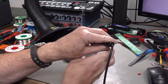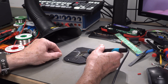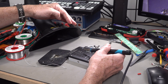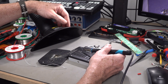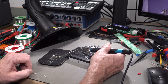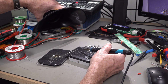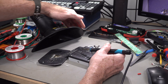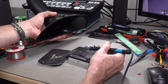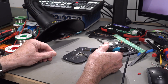I'll give you a close-up shot of that. If you're soldering stuff down at a low level, like using a stick vice or something like that — that smoke has been pulled in at the lowest setting from a hundred millimeters away. I'm very impressed. That makes a huge difference. If you have it elevated up like that, it's not as effective, because it seems to suck in air from all around it. Whereas here on the bench, it might suck some air from under the bottom, so it doesn't seem quite as effective when raised up.